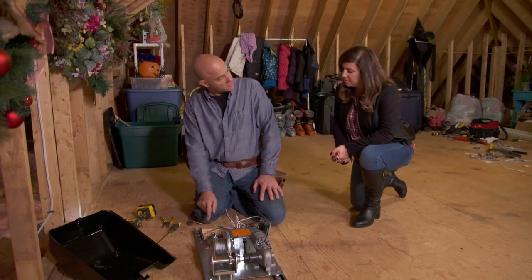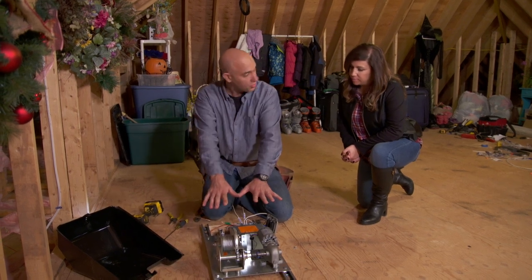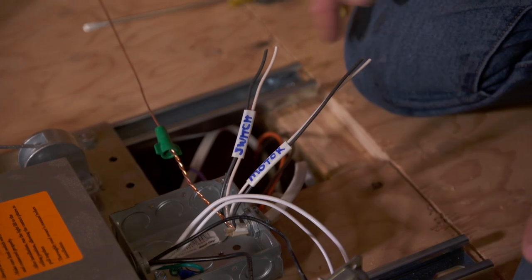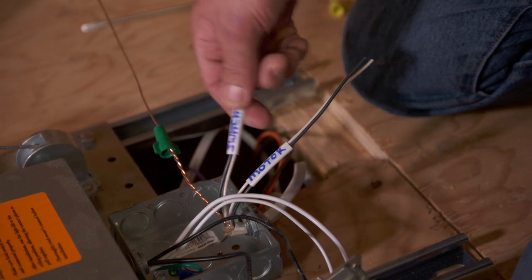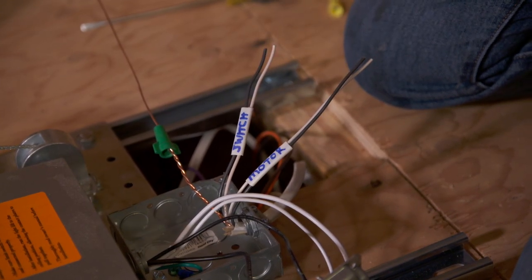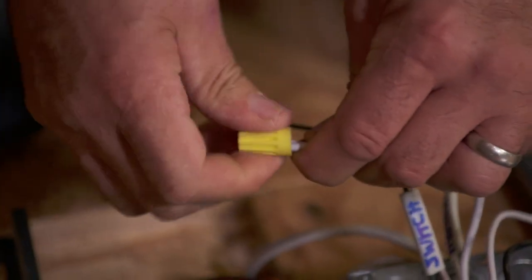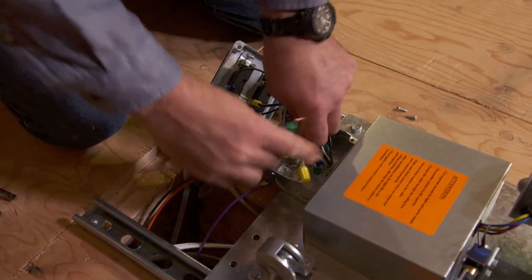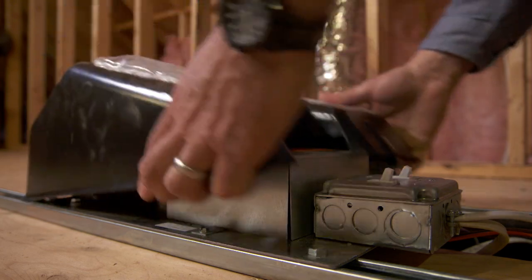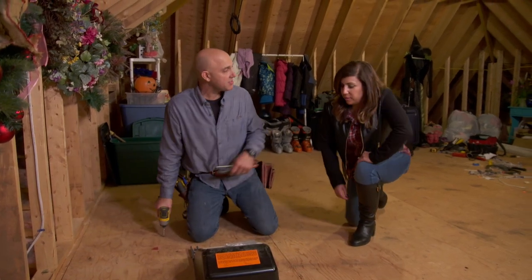You can see right down there — that box is centered over the old hole where the other light box was. I've mounted this whole structure to the top of the floor, which is really nice and secure. I had to bring constant power to this motor wire right here, which comes from a source up here in the attic. The wire that says 'switch' comes directly from the light switch and turns the light on and off. That wraps up all the connections. Let's go downstairs and check it out.